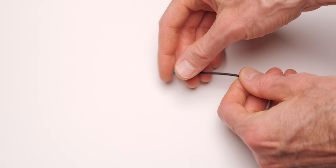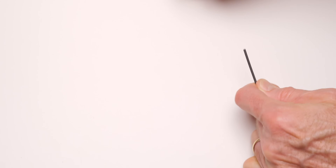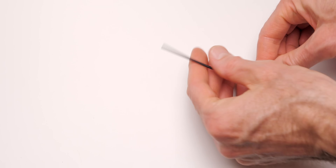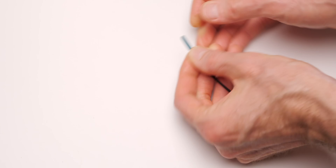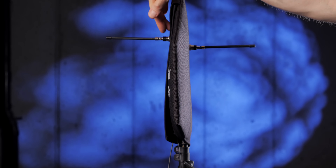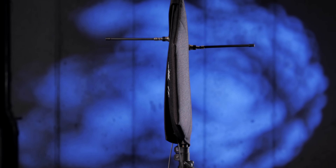Here's a very high-level overview of three different common types of antennae used for wireless microphone systems. First, there are monopole antennae — these are the quarter-wave whip antennae that come with most UHF systems. Then there are dipole antennae, which are basically a type of double-ended whip antennae that puts out a donut-shaped signal or polar pattern.